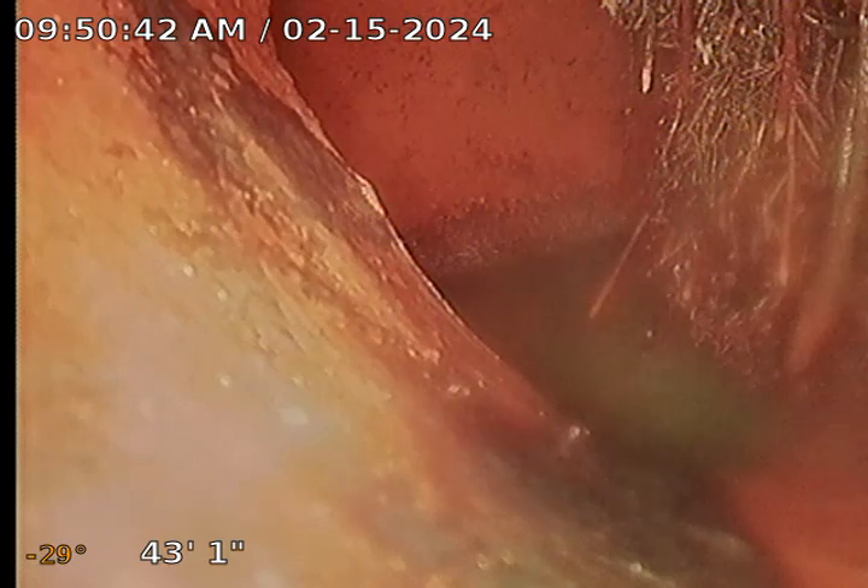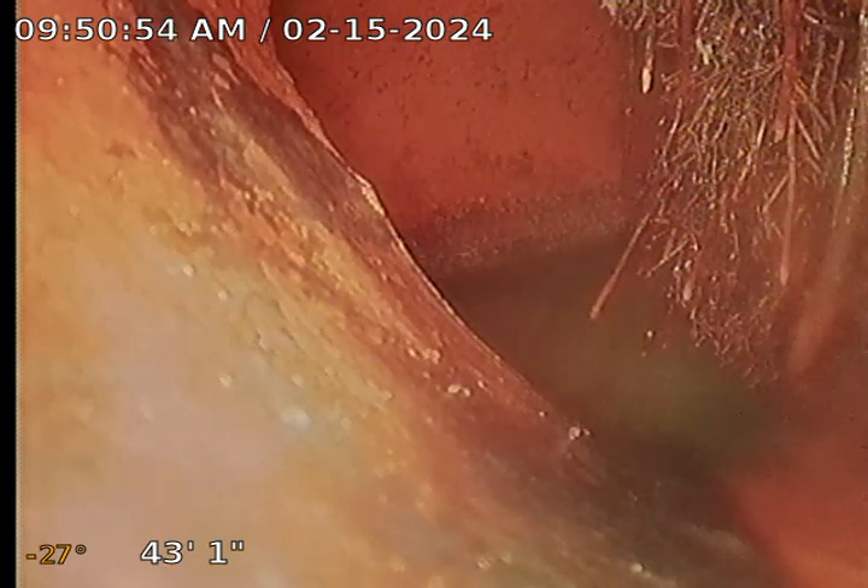Need some work. Got to run a liner in here, blow out these tree roots, run a liner. And you may need to put a hat in here to get this problem resolved, because they're coming in right at the city connection — which you're still responsible for. It's called the hat.